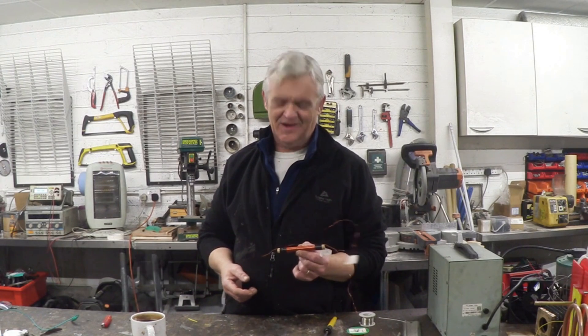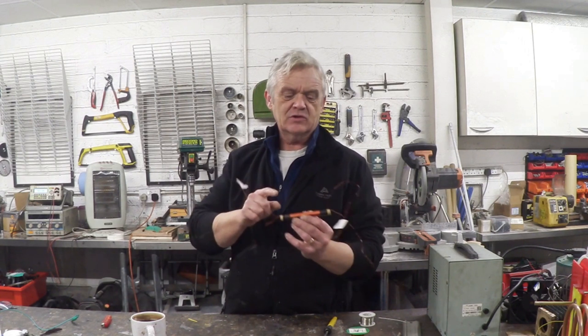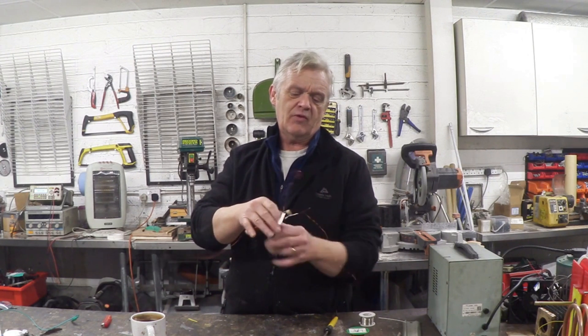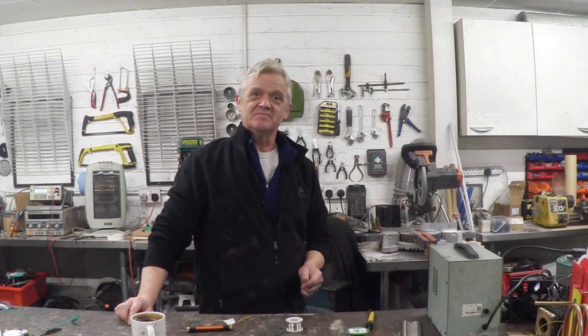Having done that, you need to identify which coil is which, because you can't tell by looking. Tag one end, then at the other end use a resistance meter or a battery and LED to find the other end of each coil. This is coil one and this is coil two. Coil one from this end needs joining to coil two from that end — solder them together. The resistance reading on each coil should be about 0.5 to 1.5 ohms.